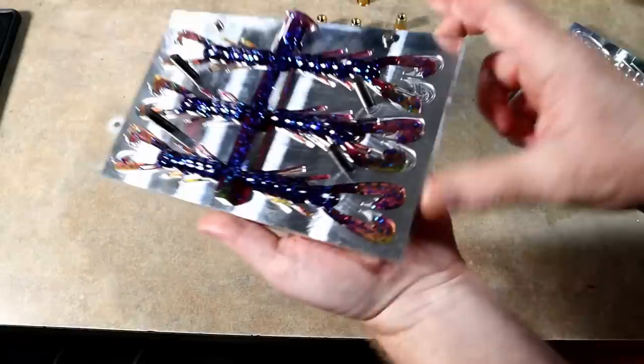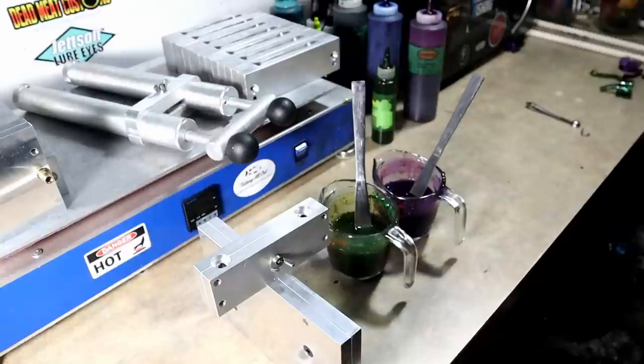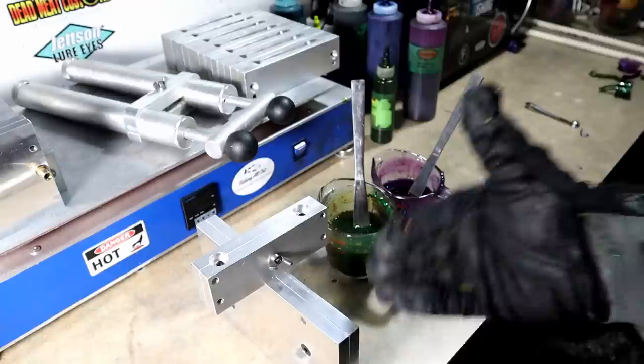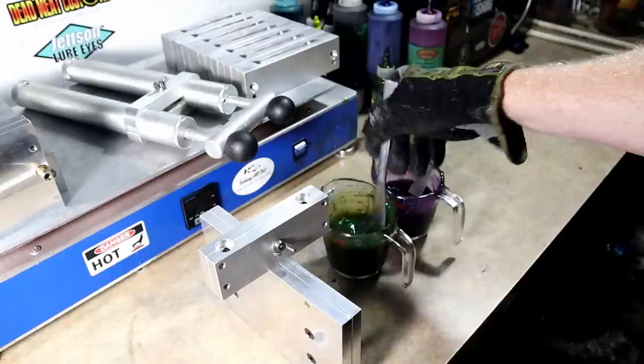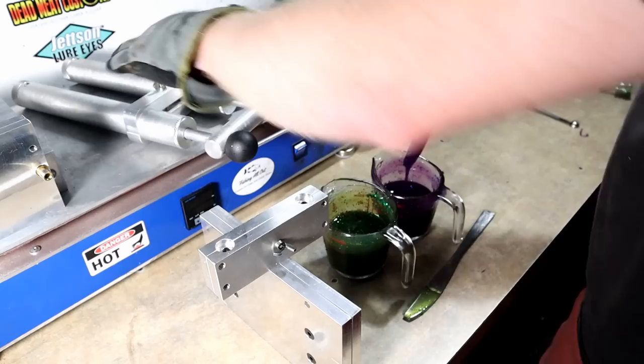The tails didn't fill — operator error. That was my mistake: I was purposely not trying to push too hard. It's a big mold, I didn't want to accidentally flash, and I hadn't shot this mold yet so I injected with a little more caution in terms of force, and I paid the price. But now we're going to get it right.